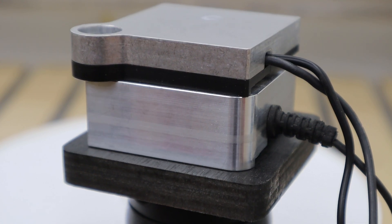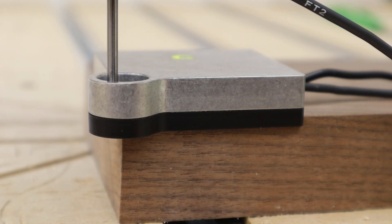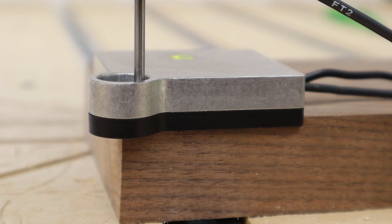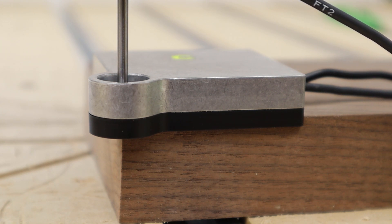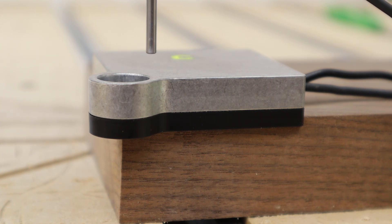Version two is lighter, a little thinner, has a different finish, and comes with probing rods to allow you to zero from within a circular pocket. One thing I did notice — and you'll see it in the video clips — is that with the version two Bit Zero I can see it move around as it bounces off the edges during the X and Y axis probing. If that's going to be an issue for you, you may consider taping it in place or holding it with your hand.